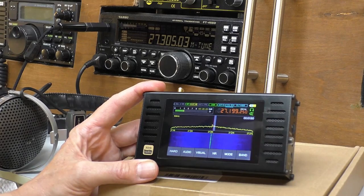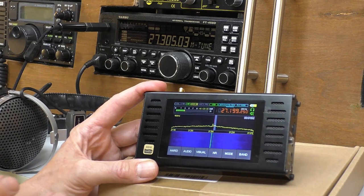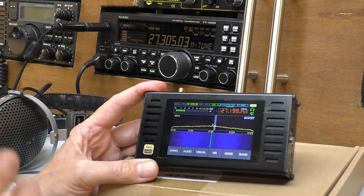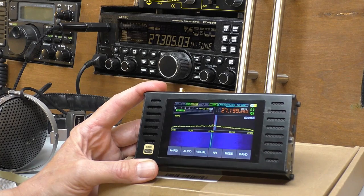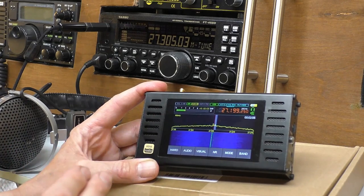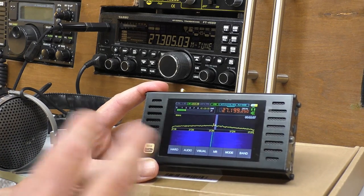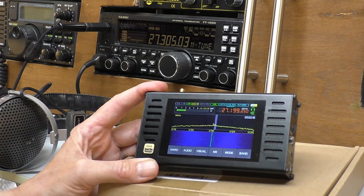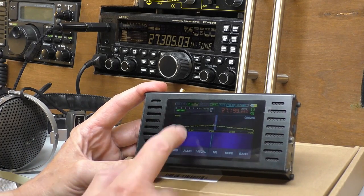So, conclusions — good points and bad points. The receive is really, really good, and it's also so easy to use, especially if you're used to shortwave listening where you're twirling a lot of VFO knobs. With the waterfall and spectrum display you just see a peak and you press on it — simple as that. I've just got the encoder tuned right down to use it as a clarifier to bring stations in. The stereo speakers are okay — maybe a little bit of a gimmick. They are a little thin when you turn up the volume, but you've got a 3.5mm jack so you can plug in a cheap CB speaker, which improves the sound immensely. The noise reduction feature was a real boon on the stronger stations, knocking out all the background hiss and noise — though I did switch it off on the weaker 10-metre stations as it was suppressing some of those signals.